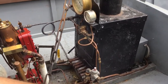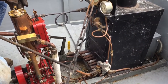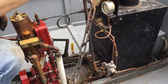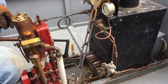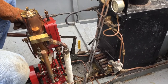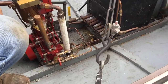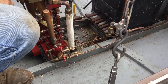The guy who ran it before made this rod here to adjust it. He says what he does when he runs it all the way open — he'll turn it and then rest it. You can turn it like this; that way you don't have to reach down there. It's just going to really take off. When you come into the dock, you're going to have to shut the burners down and just feather it a little bit to get closer to the dock. It's real fast and responsive.